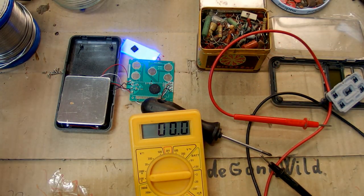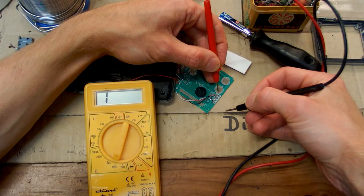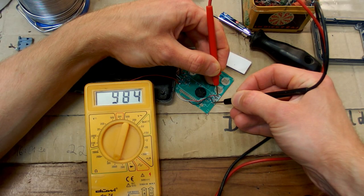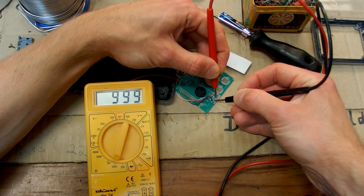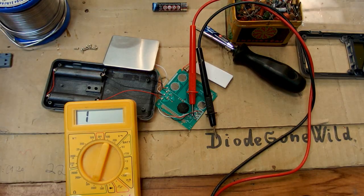So the analog to digital converter has to be able to measure quite low voltages. And the resistance of the bridge is, at the input, about 1 kilo ohm, and at the output, also about 1 kilo ohm. I basically measured 2 resistors in series and 2 in parallel, so each of them also should be 1 kilo ohm. And now, putting it back together time.